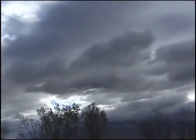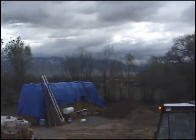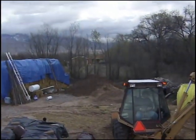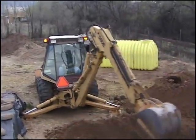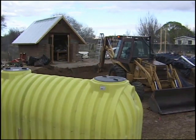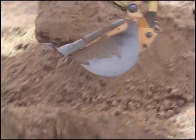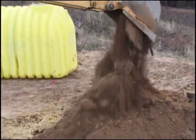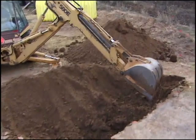To find the most cost-effective tank, I did a lot of research as to what was available. Concrete, fiberglass, and steel are just some of the available materials. For my requirements, it turned out that a 1,500-gallon polypropylene septic tank was perfect. They're easy to obtain, they're lightweight, and they cost about 50 cents per gallon of capacity. In addition, the plastic is very easy to drill, and that makes it easy for adding plumbing.